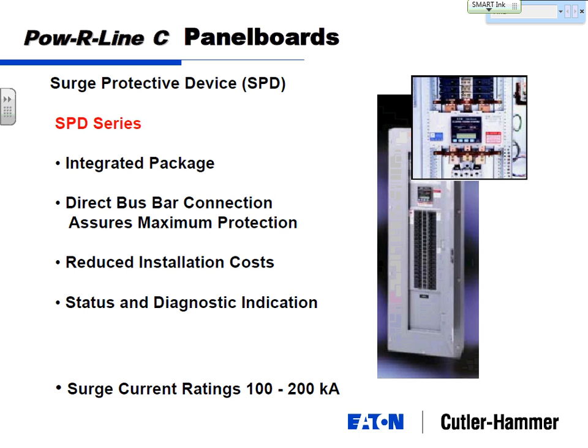And that's why you'll see, if you read the warranty manuals for your TV, and I had to do this when I bought mine, it says in there, warranty is only valid when your TV is connected to a properly rated surge strip. They'll tell you what the rating is. Otherwise, they won't even warranty it because that will lead to failure. So those two types of what I'll call transient voltages: number one, outside the building, lightning; number two, inside, internally generated from fax machines, copy machines.